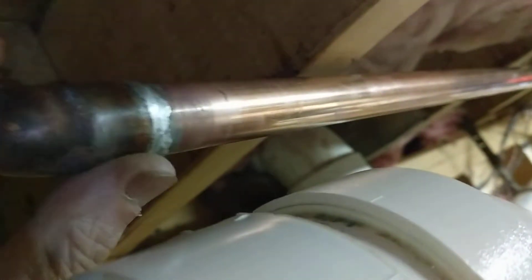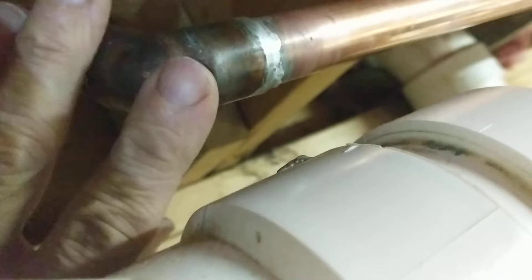In this case that was actually a new fitting, because the previous fitting had to be cut anyway. And once it was taken apart, it's easier to use a new fitting than to try to reuse the old one, because you have to remove solder from the inside and be careful it doesn't get dented. When doing this soldering, this would have been one of the first joints soldered in position. It had to be supported underneath while this was being done — it would have actually fallen through and the whole thing would have rotated. So there was a temporary support placed here when that was done.